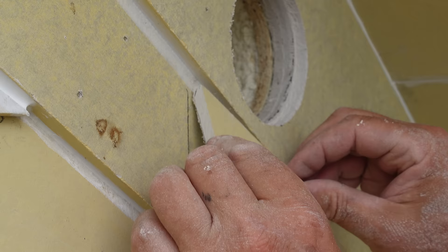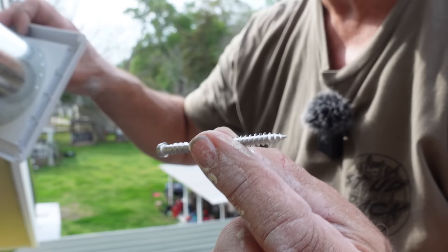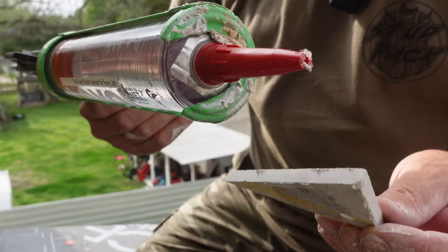Already got it marked, I'm just going to squish it in place. Boom. I've got all these pre-drilled because it's cement board, and Jordan wants to use stainless steel screws to attach this to the building. I need to put some caulk on the back of this — let's get another tube. New tube. Let's put some on the hypotenuse.